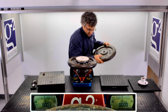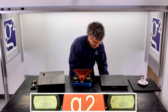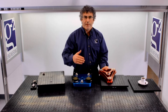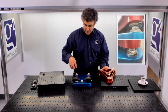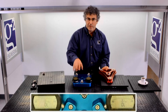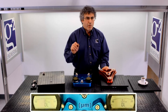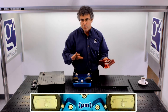I'll remove the weights. This demonstration unit showcases the product. What we have here is a blue and red component, which represent the two halves of your system that you want to mate together. The silver stainless steel components are the spherolinder product, and each stack has the V-groove, the spherolinder, and the cone. Additionally, we have a tooling ball and two LVDTs that measure its position relative to the blue component, indicating repeatability. The readout resolution on these LVDTs is 1 micron, or 40 micro-inches, which is just at the edge of what a mechanical measurement tip can measure reliably, so overall precision of this setup is about plus or minus 1 micron.